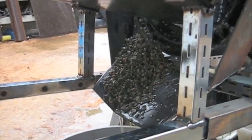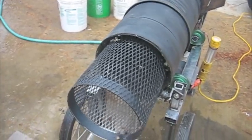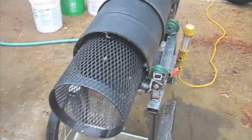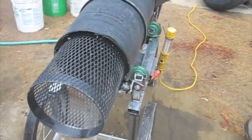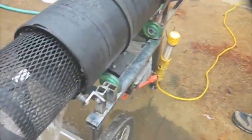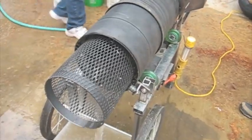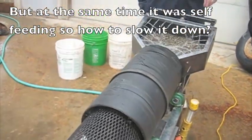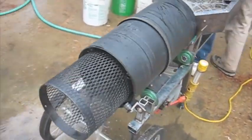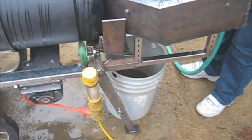It's building up on the bottom chute too. This bearing is jammed — it's jamming with rock. It wasn't turning. So that will have to be changed. We can extend this post, put it up here. I think when I dumped the whole thing, I just fed it way too fast. Because we got it backing out of the lower chute and falling on the ground.